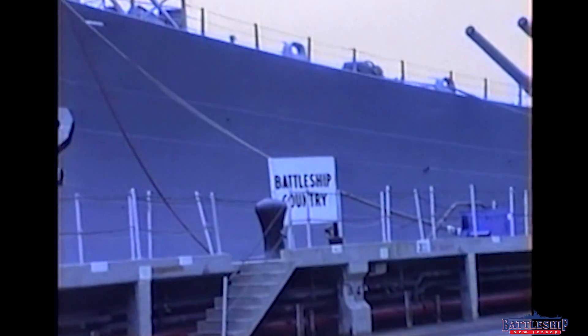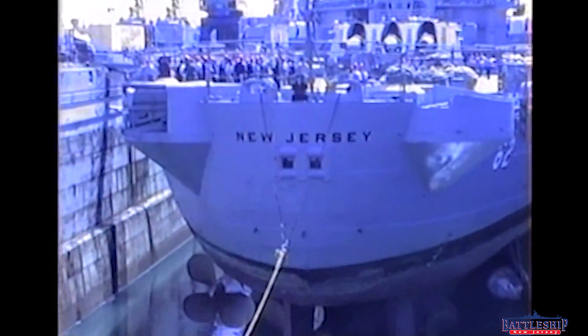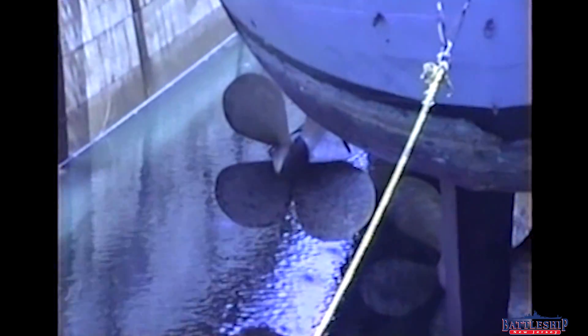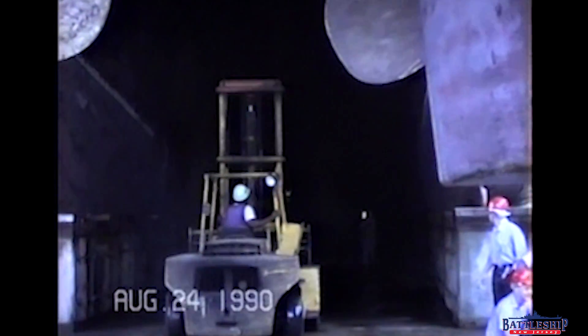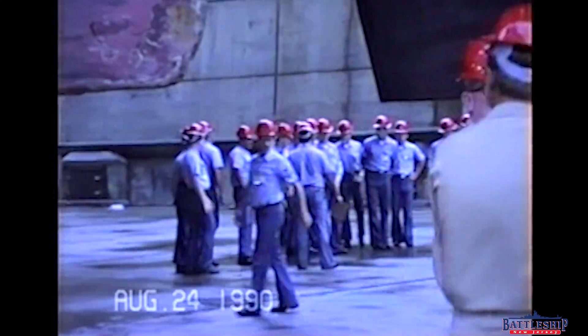That's what the ship sits on when she's out of the water during a dry dock period. The ship comes into the dry dock and she has to sit down on the keel blocks. These keel blocks are somewhere around four feet square, so they keep the ship off the floor of the dry dock. They support the entire weight of the ship and ensure that through-hull openings for sea chests, propellers, and rudders that project below the bottom of the ship are not pressed against the ground.